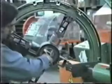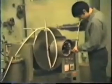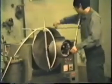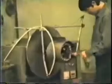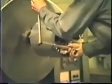After the winders have finished making the final connections, the stator is then brought to our trickling department. These machines have been in use since 1977. First, we mount the stator on the turntable and adjust the trickling tubes, the heat sensor, and connect the motor for 230 or 460 volts. With some minor adjustments, the trickle process is ready to start.